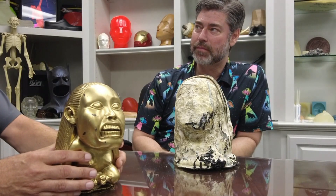This happens a lot — sometimes you get a legacy mold and you need to redo it, but the mold itself is on its last leg. You've got one or two shots maybe, and you risk that one more pull will rip the mold and it's done. So you better get it right the first time. Obviously this is a solid part, and whenever you pour a big solid part you've got potentially a lot of exotherm, even if you use a low exothermic material like our 1630 which is filled.